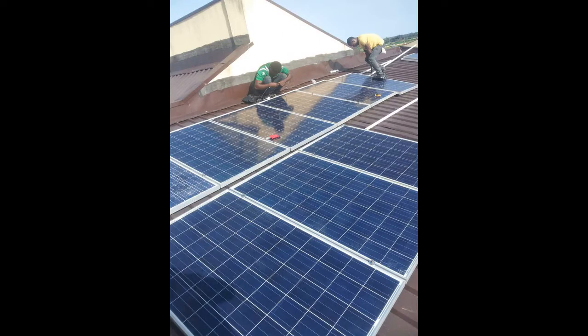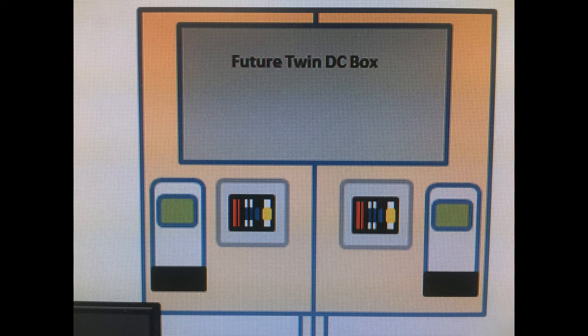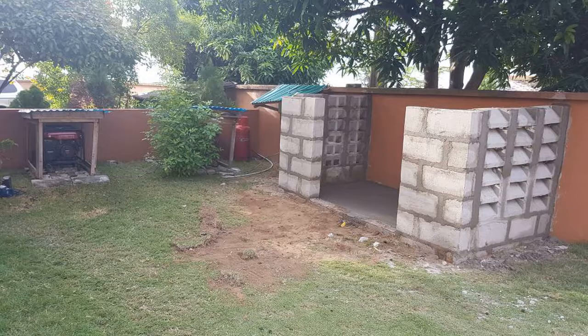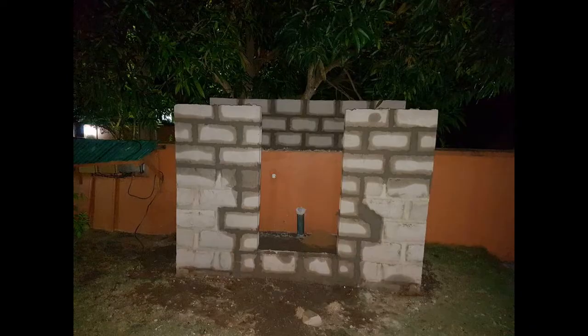But there you go. The other good thing is that the roof is near flat, so the power that's going to be coming from these panels will be absolutely exciting. Having done the schematics for the power room and taken the necessary measurements, we were able to hand those over to our building contractor who does sheds for us. One of the instructions I gave for the foundation was that a 4-inch PVC pipe — typical waste pipe — should be laid underneath the foundation, coming in against the fence, going under the garden all the way to the house and into an inspection chamber where all the cables from the roof will be routed. You won't be able to see any cables.